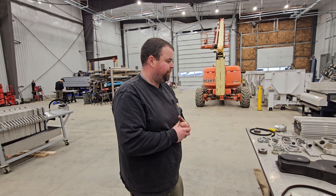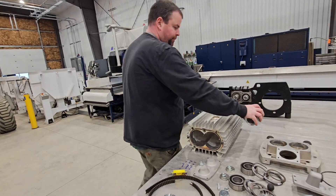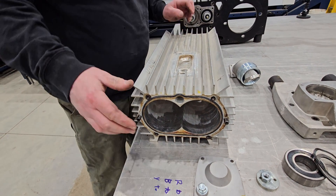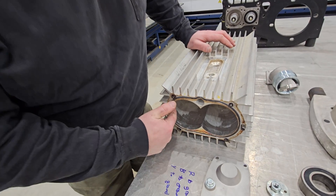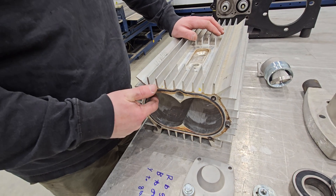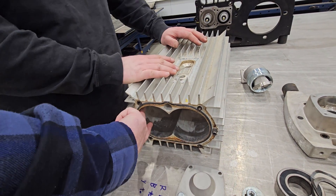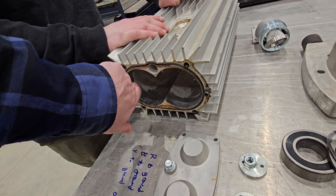So let's take a peek at the inside of that chamber. You can see here there's scratching and galling all the way down. Which end is which? This is the high compression end — this is actually where everything comes out. It should be smooth, but there are a lot of chunks and ridges. That one's a good one there — that's probably where it stopped dead. That's like a gash. Yeah, that's where it stopped dead for sure.